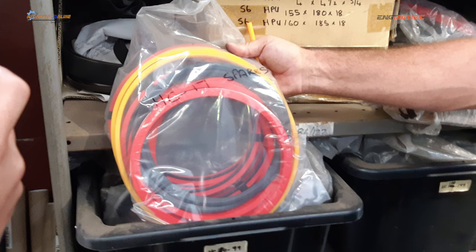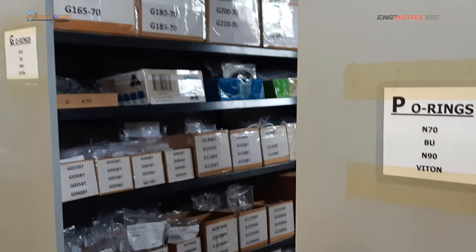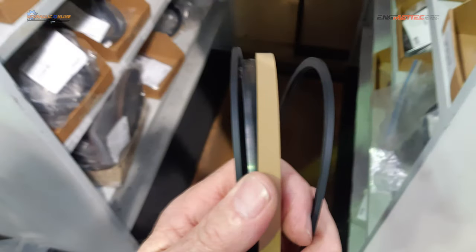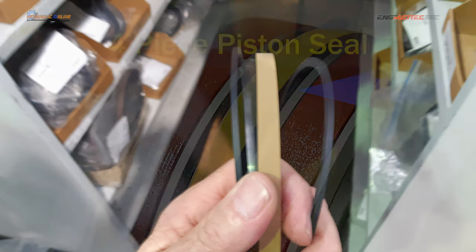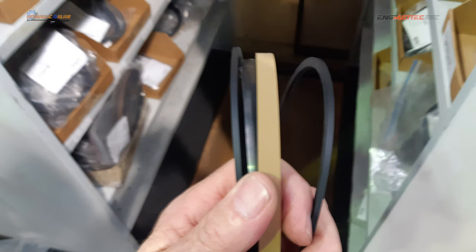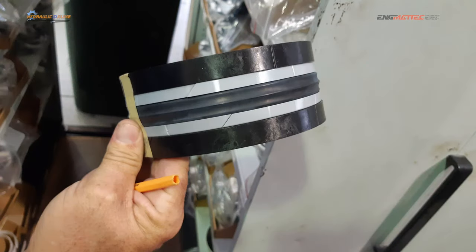Here's a series of piston seals made up of probably five pieces — five-piece piston seals. Quite a large size, looking up around the five-to-eight-inch range, which is getting up there in size as far as cylinders are concerned. There are also lots of different types, sizes, and hardnesses of O-rings — metric O-rings, silicone O-rings. This is a four-piece piston seal: two backing rings on either side, a dark O-ring in the middle which is the exciter ring, and on the outside a solid Teflon or metal-Teflon composite that takes up the pressure and prevents leakage from one side of a cylinder to the other.